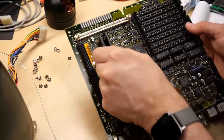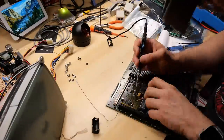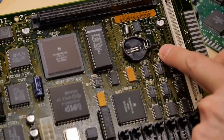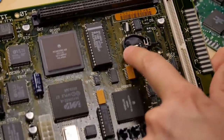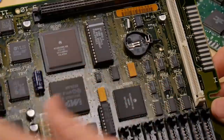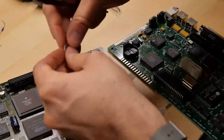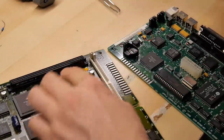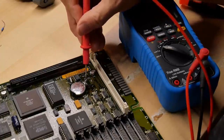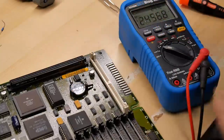The last thing I need to do is remove this battery holder and put a CR2032 there. I did it without a bodge wire — I just used a little piece of off-cut resistor to extend the positive leg to the original positive location, which runs over to this diode. I put a little heat shrink on there and a little hot glue under there so it's held down. There's more space on this motherboard so it doesn't even have to be a little crooked like it does on the Classic. I'm out of CR2032 batteries, so I'm going to steal the one off this Classic here and install it in the Mac SE30. Quick test — we're getting three volts. On the diode we're also getting three volts, and on the output of the diode, which is this via here, we're getting 2.7 — voltage drop, but that is expected.